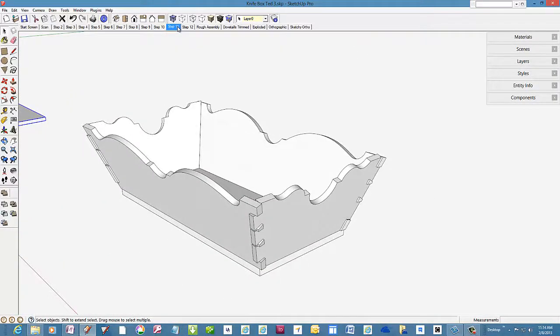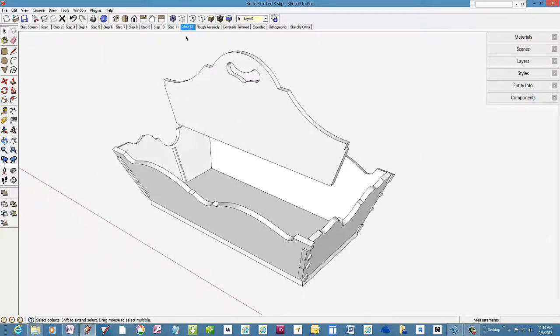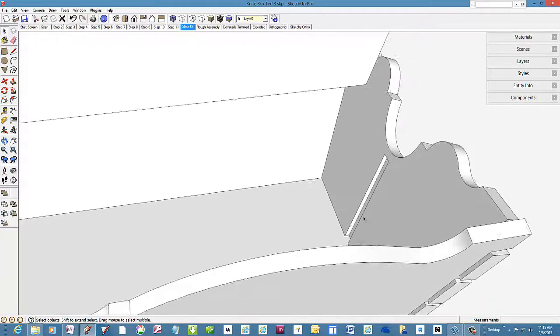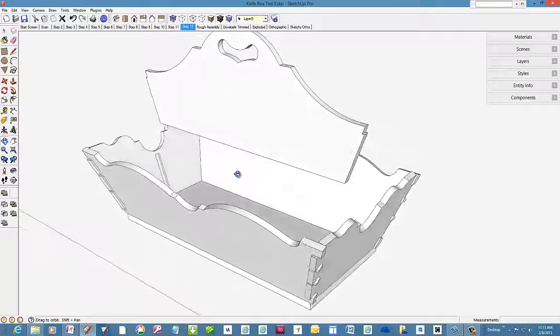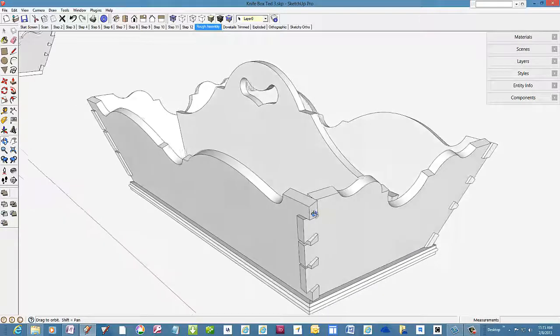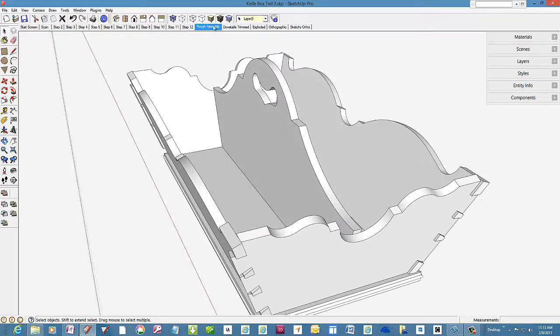Now we can add the mid-spar handle. This requires a stopped dado in the inside face of the ends and a little notch at the top edge of the handle. I applied a molding along the perimeter of the base with Follow Me, completing a rough glued up box ready for final shaping and hand planing.